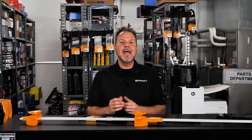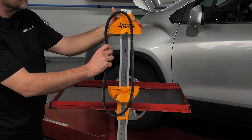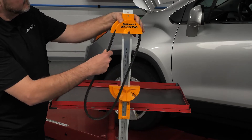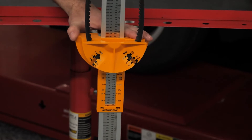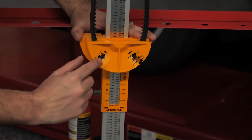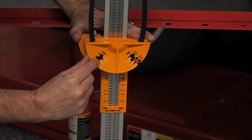The tool can also measure V-Belts of various widths for standard and metric sizes. For multi-rib belts, it can measure a belt as small as three grooves and as large as 12. To measure V-Belts, place the belt in the V-Belt groove and pull the belt taut with the movable head. Look at the gauging slots — by looking where the edge of the belt is in the slot, you can determine the width of the belt in inches or millimeters.